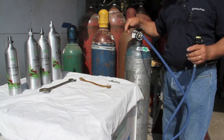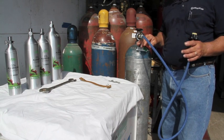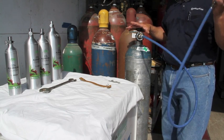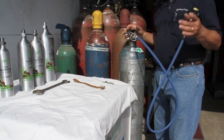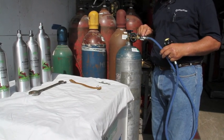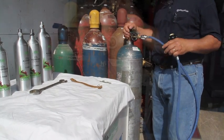This is a ball valve — this is going to turn your supply on and off. This is the on position, this is the off position. Once you've established the connection between your supply cylinder and your fill whip, you can open the valve and you'll see that nothing comes out the other end. This little block right here is a bleeder valve, which is made to depressurize this line after you've filled a cylinder.